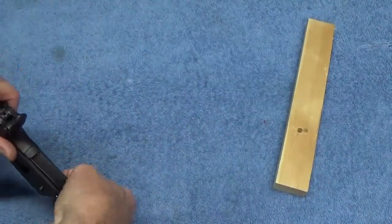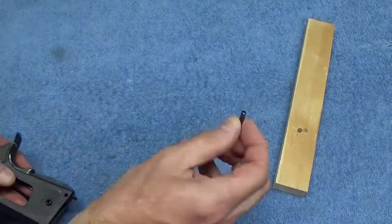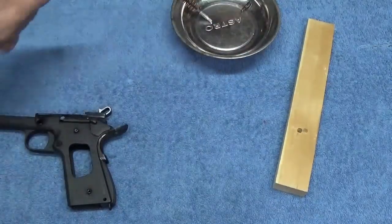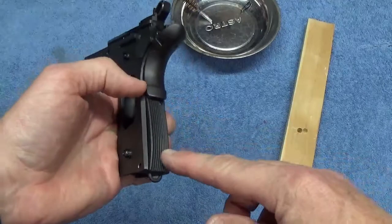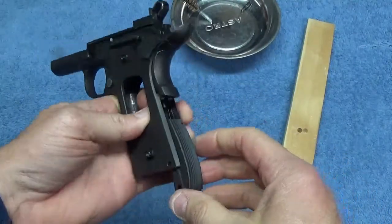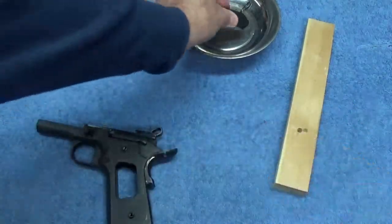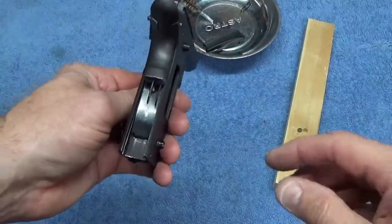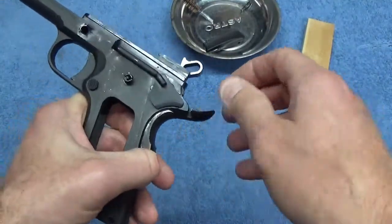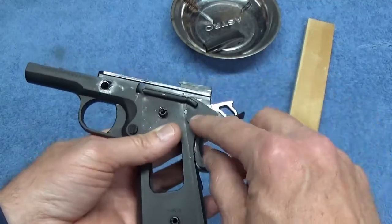You can see it'll push out the rest of the way. Save your pin — I'm going to put my parts in a parts tray. The mainspring housing should slide down; you have to pull on it a little. There we go — the mainspring housing is out. We're not going to take that apart. To take the hammer out and the grip safety, we're going to have to slide that back. Now it's not under pressure anymore. To get this safety out, you're going to jiggle it with the hammer back and kind of work it back and forth and pull it out.